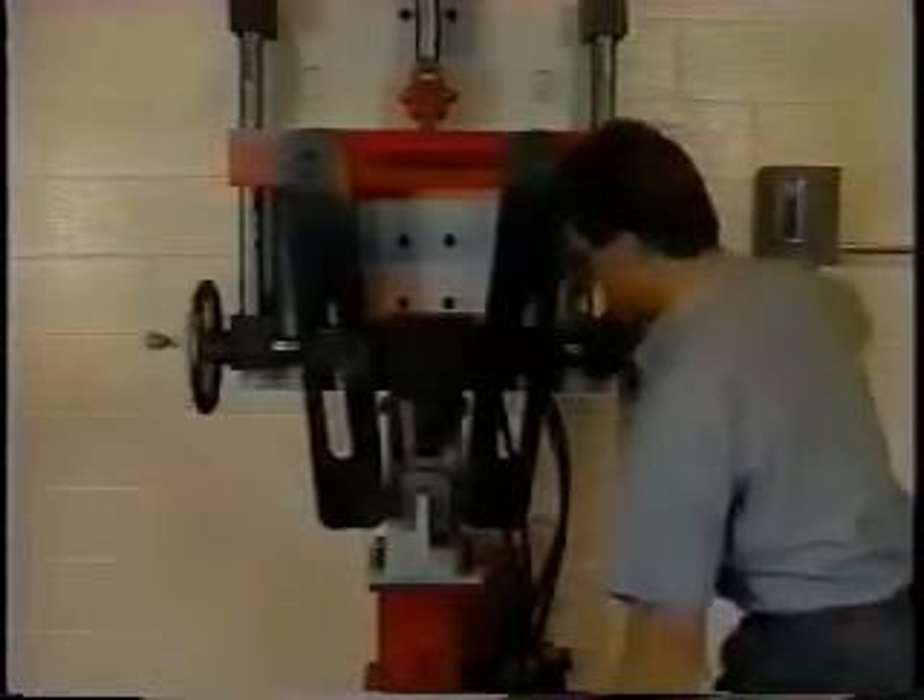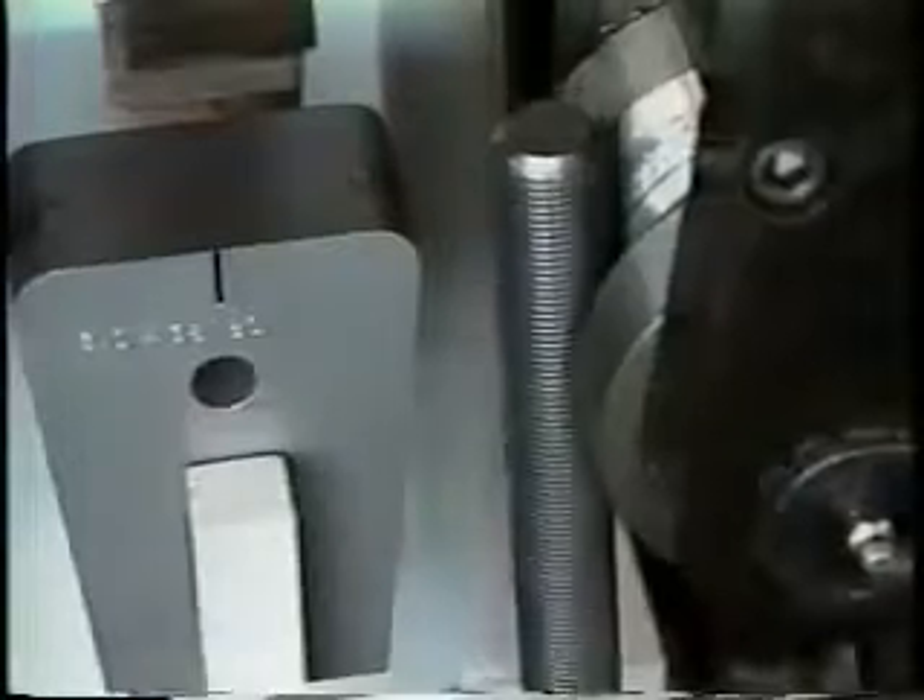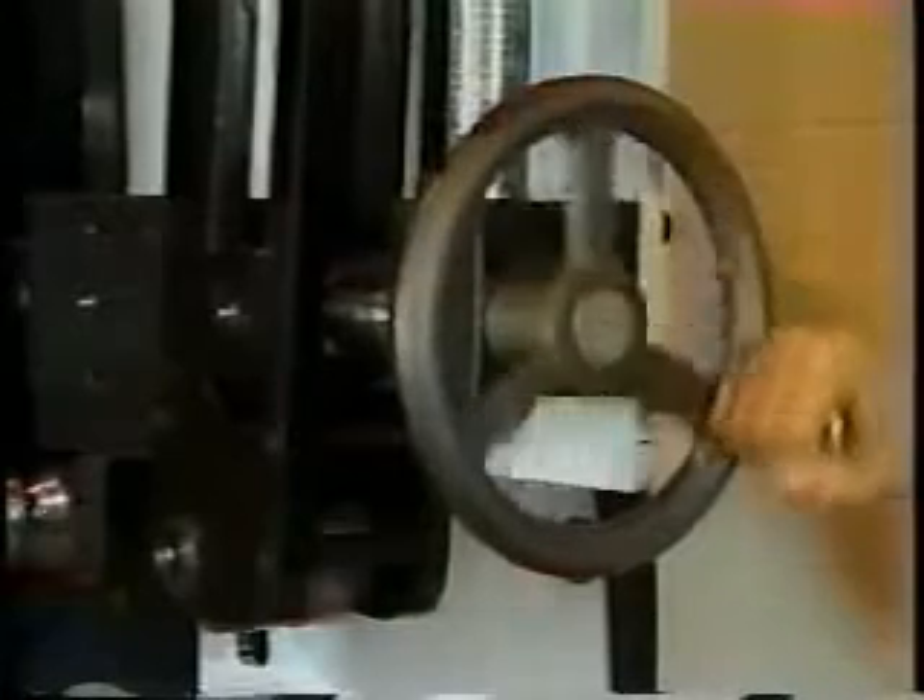Next, adjust the machine for the diameter of the rod to be bent. The distance between the rollers and the die should be a minimum of 1/8th of an inch plus the diameter of the rod. The Center Mark Bender sets up with a patent-pending single-screw adjustment, setting both the overbend angle and the width between the bending arms simultaneously, which assures equal distance between the bending die and forming rollers during setup.